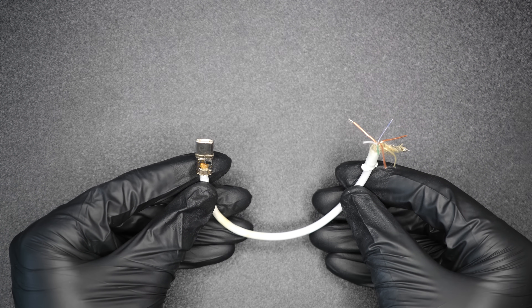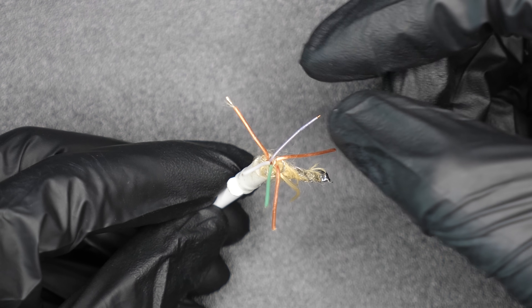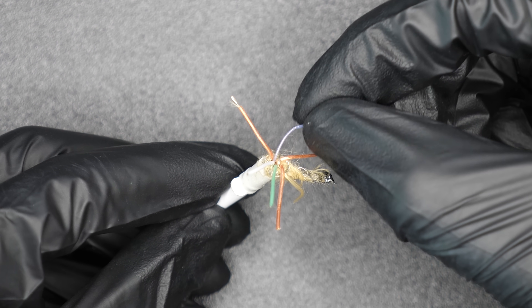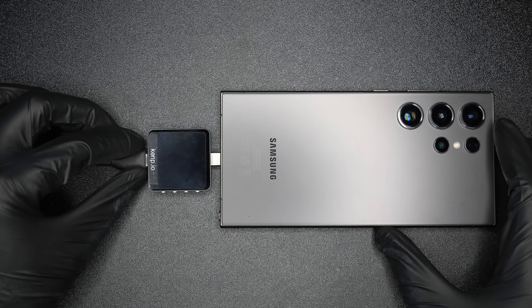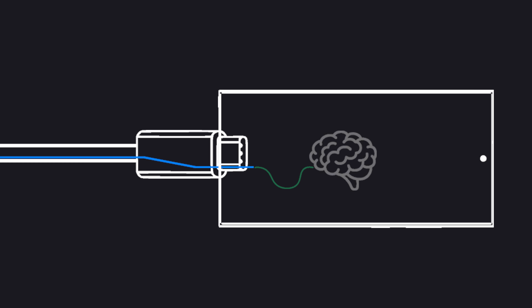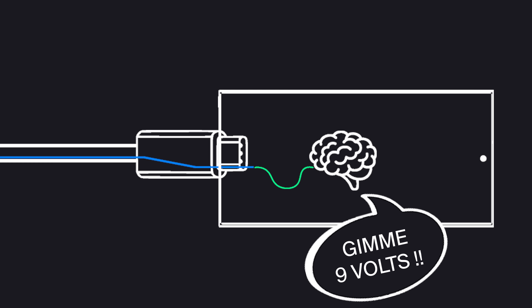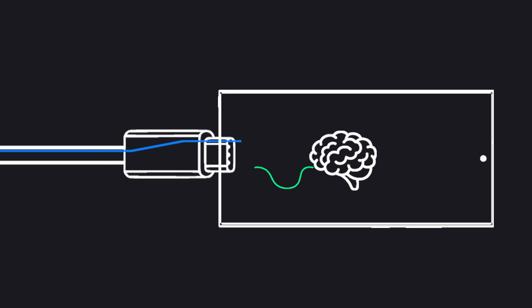So here's a cut-up USB-C cable. It's got different wires inside — they all have different functions. But the most important one today is the blue one, the configuration channel wire, otherwise known as the CC wire. When you plug it into a phone that has a USB-C port by default — here's one from Samsung for example — the wire connects to the right pin, allowing the charger and the phone to talk and negotiate how to charge. But this cable is reversible, so there's actually another pin inside the phone that it can talk to.